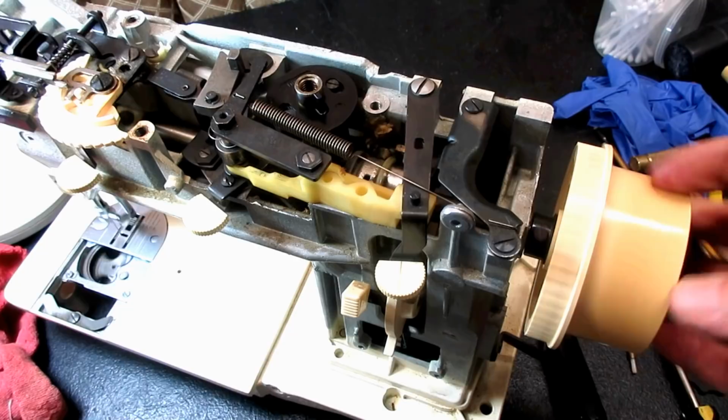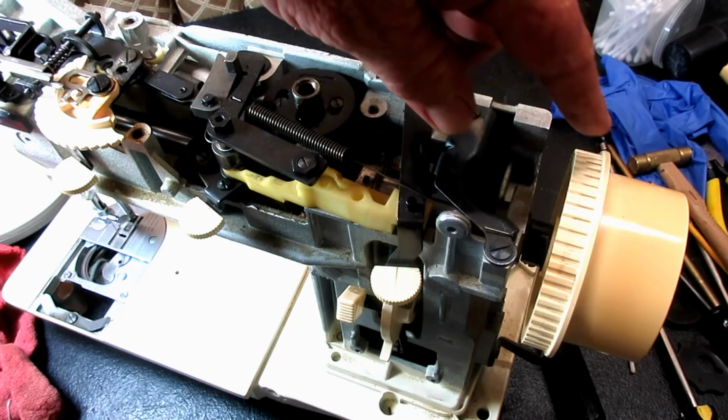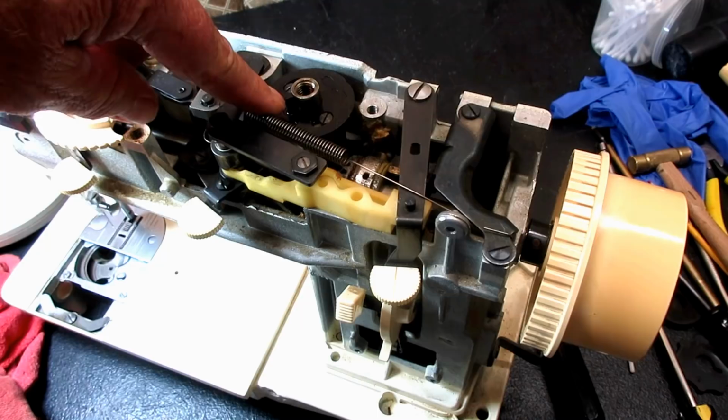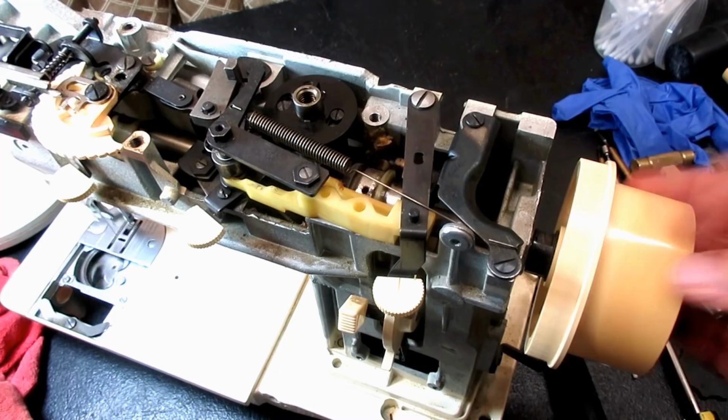You've got to pick something and turn the hand wheel like 16 or 18 full turns, or like 30 half turns, to do a whole revolution of that camstack. Because you might not have binding right there, but you might have binding someplace else. So pick something. I pick the key, that little key that sticks out for the cams, and I just start turning the hand wheel until that does a complete 360.